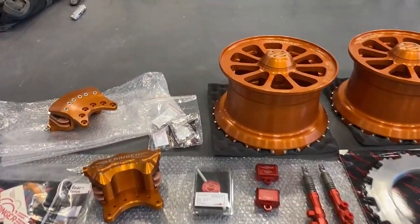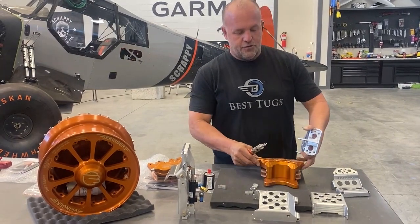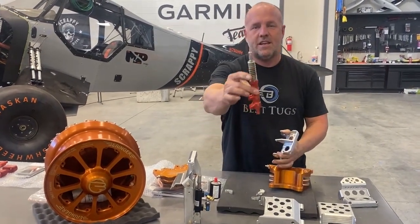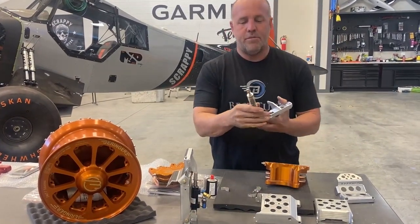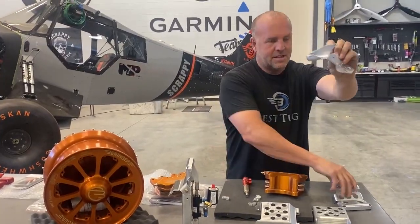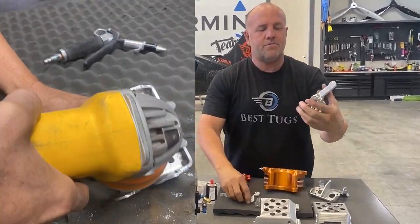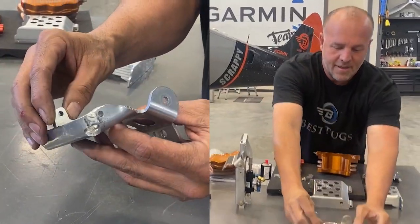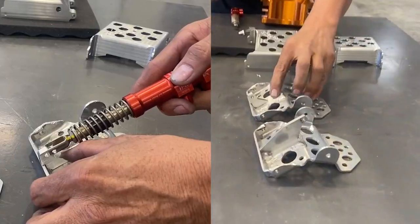this is going to be the braking system I'm going to use, but I need more fluid. I need to pump more fluid into a three puck system instead of a two. And so this is the Beringer ram I need, to give you an idea, to put the pressure. And obviously this won't fit into there. So I am using this, but I cut off the back and I drew up in the computer this new part that will go right there. Completely changes the geometry of that part so I can still use this.